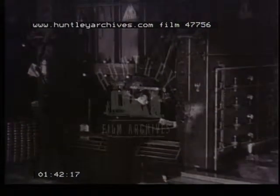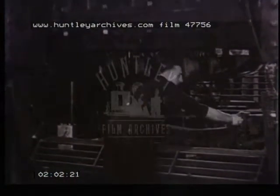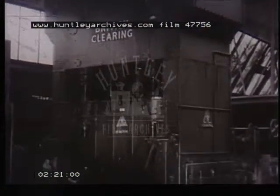These components have been very accurately machined and hand-wrought to such a degree of precision that the thickness of the sheet exactly fits the clearances between them. Before the punch comes into action, another part of the press tool comes down onto the outer edges of the steel sheet, gripping it firmly. When the sheet is thus held, the punch comes down inside, overcoming the resistance of that grip. The tightness of the grip is predetermined to prevent wrinkles forming in the steel as it is forced down into the narrow space between punch and die, where it assumes the required shape.